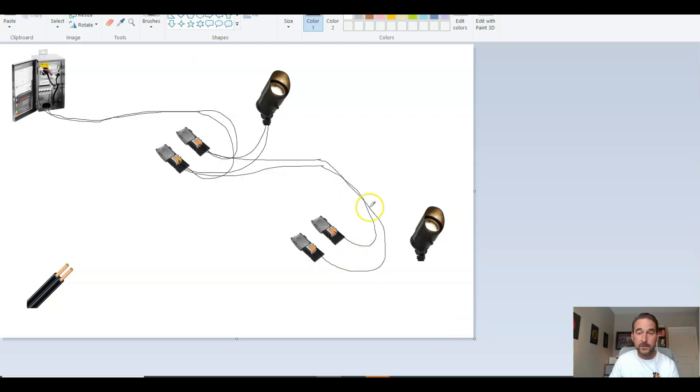I'm going to show you a scenario where this is our last fixture. We've got our two wires coming off the fixture going into our connectors. This is our last light on the line, so we're not going to use all the holes — we've only got our wire going in and then our fixture wire. You're just going to have two wires in that last connector with an extra hole — no big deal, you can totally do that.